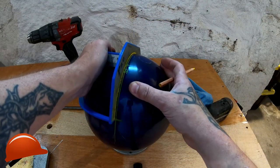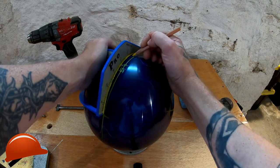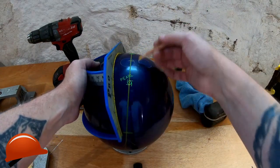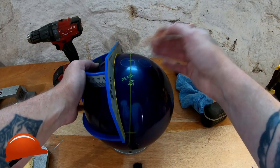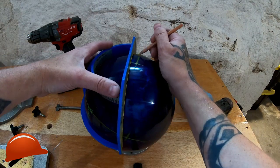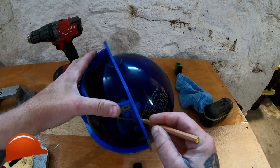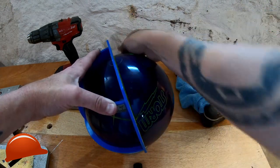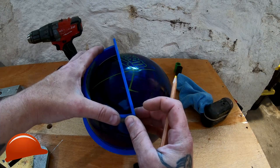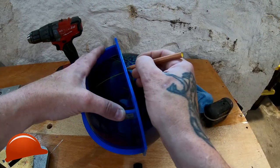For this layout, I want my finger holes to be an inch and a half below the pin, so I went an inch and a half down. I go approximately an inch and a half up off the PAP — my PAP is five and three-eighths over by an inch and a half down. I stretch the line across, then come back and check to make sure. I was a little off, but that's alright, I can fix it.